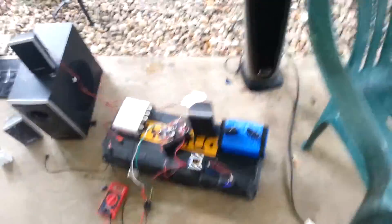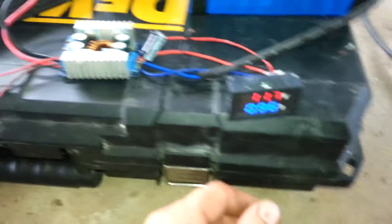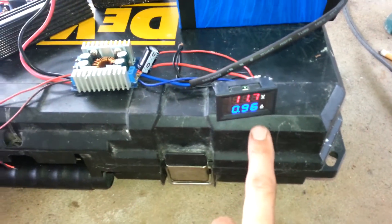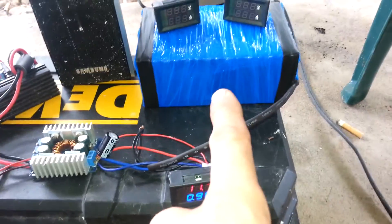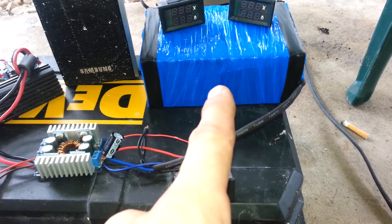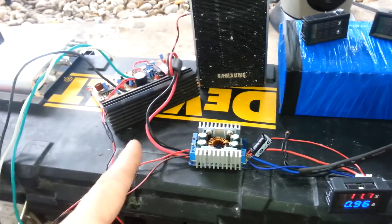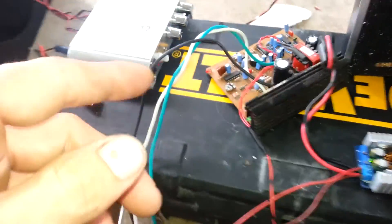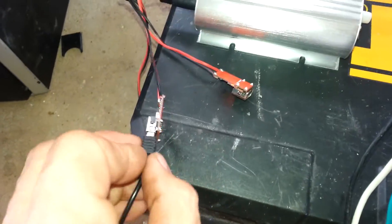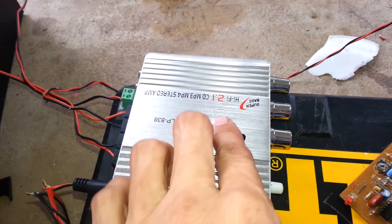This one right here is a small unit I've just done — a small 12-volt battery pack. This is a boost-buck converter because this battery pack can go down to 7 to 7.5 volts, so I use this boost-buck converter to maintain 12 volts. That 12 volts also has two USB ports.